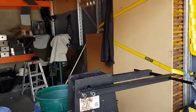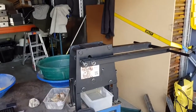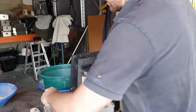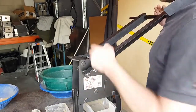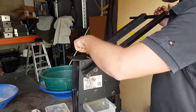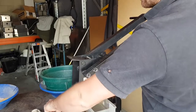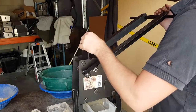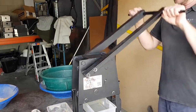It's a very simple unit to use. I'll just move that camera a little bit and chuck a rock through for you. By raising the arms, you actually open the jaws up, which will allow you to put a larger rock in. You can put a couple of rocks in at a time if you like — that's quite a big one there. You'll see the kind of force required for a large rock.